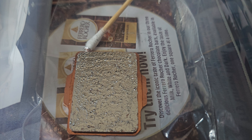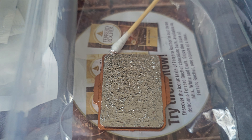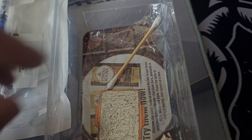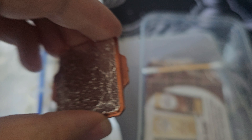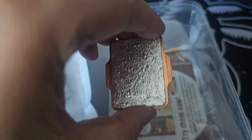If you're going to buy a full copper IHS like I've done, make sure you prime it up first — basically put your liquid metal on it first before you do the de-lid, ideally a few days before. I did this about three days ago, so it's been literally soaking for three days now.